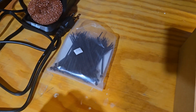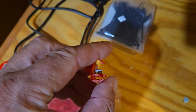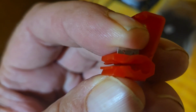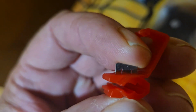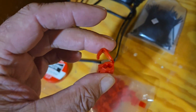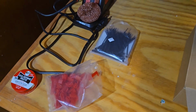And these are great for joining wires, little suitcase connectors. They're pretty cheap as well. Get them on Amazon, and I forget what the brand name is, but basically you put your two wires in the hole, and then with a pair of pliers, you push down on this little blade thing, and that'll cut into both wires, kind of fuse them together. It'll conduct electricity from both wires into here, and this is just a little lid. You squeeze that down with pliers, and it'll lock into place. It's very easy and very handy, and I love them. So that is really all I use for wiring.